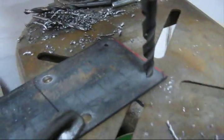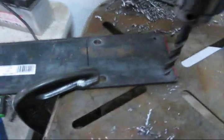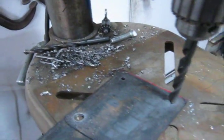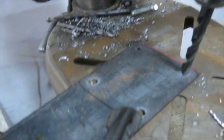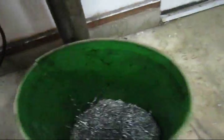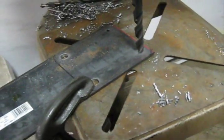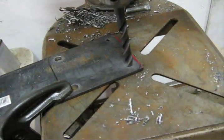Before you do the smaller holes, you should always use a center punch and a big hammer — it just aids the bit in the cutting sequence. Since yesterday, I made that other puller and I made those two brackets this morning and now this one. I went through this much metal shaving. There's still some on the ground and scattered around here, so you've got to do whatever you can to save these drill bits.